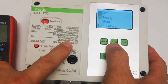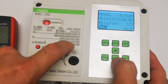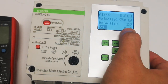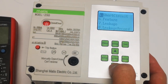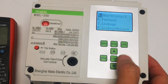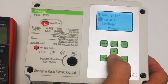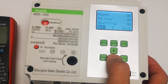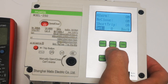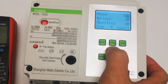So you can limit this current from 250 to 100 to 125, and these time delays all apply to overload. This is a short circuit — it's the same. You can set up this value and the time because we can detect the current inside, so you can do this kind of limit and setup configuration. Alarm, reclose, time, short trip — you can set each one on or off.